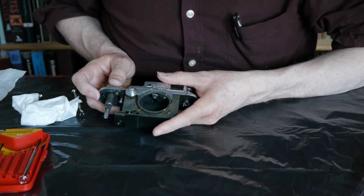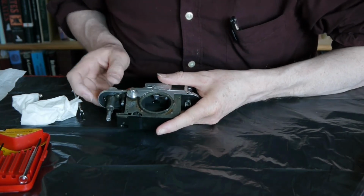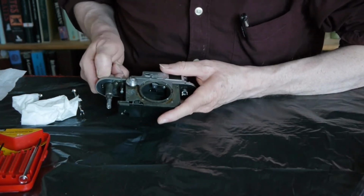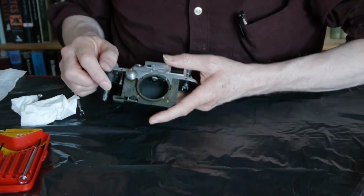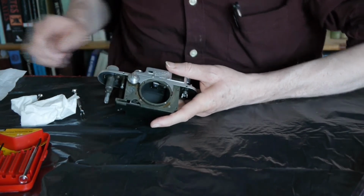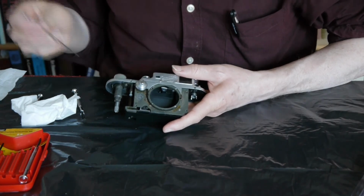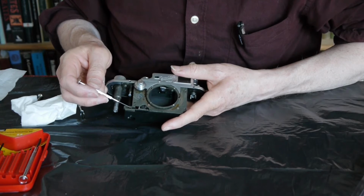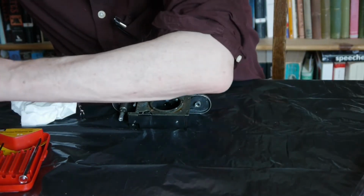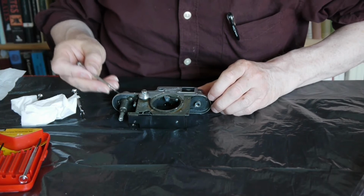All that remains to do now is lubrication. So we've got to be very, very careful with lubrication. The slow speed mechanism must not be oiled. No oil must go anywhere near the slow speed mechanism. So the gears that I can see to lubricate are this large gear set down here. And I'm going to put literally a very small drop on the end of this screwdriver onto this gear set here, and hope that that is sufficient for its requirements, and indeed isn't too much. So let's get a little drop of oil on there. And when I say a drop, I mean the tiniest drop.